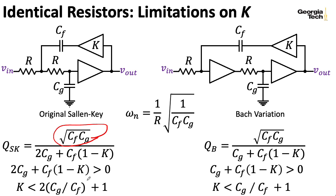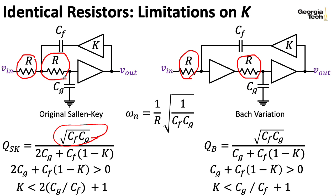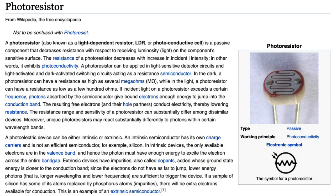The version of the MS-20 we looked at was based on replacing the resistors in the Bach version with operational transconductance amplifiers. What Buchla did with the low-pass gate is to take these resistors and replace them with light-dependent resistors. We shine LEDs—light-emitting diodes—on those light-dependent resistors, and when we change the current going through the LEDs, we change the resistance of the LDRs.